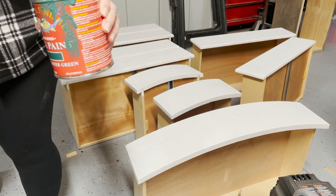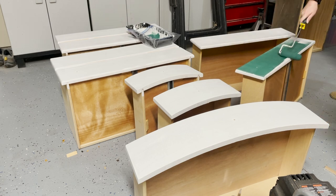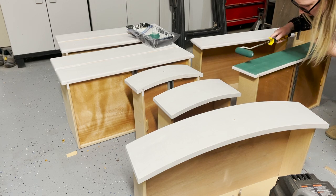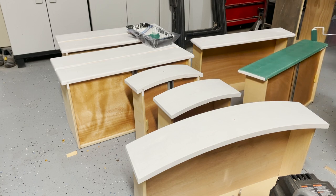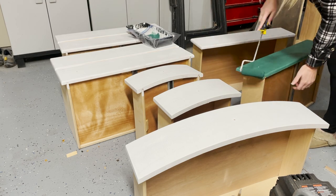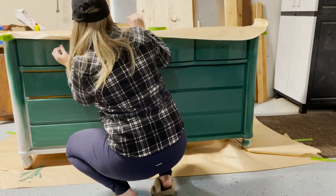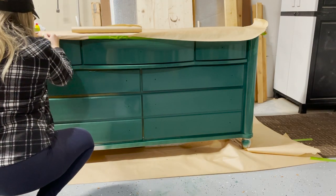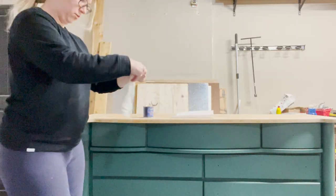Next, we are using paint. I tried General Finishes Milk Paint. It dries more like an enamel paint than a normal milk paint — typically milk paint is very chippy and doesn't apply predictably. This one was really good. It's very similar to Sherwin Williams Pro Classic Paint, with almost a self-leveling quality. What you can see me doing is applying this with that same foam roller, but I actually hated it. Use a brush — it goes so much better with this type of paint. A general paintbrush worked out perfectly.